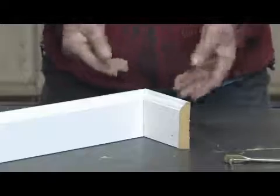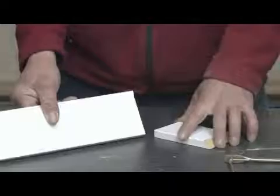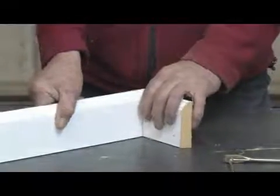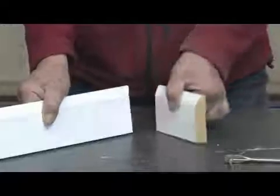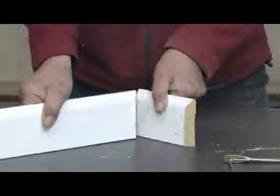Basically what that does is you've got a corner joint. Instead of making two 45 inside cuts joined together to make a 90-degree angle on your inside corner, you have one piece that's just butt cut on a 90 and the other piece butts up against it with the use of coping. How we achieve this, really easy.